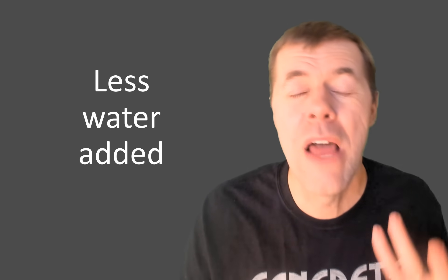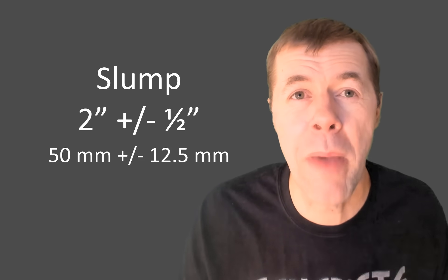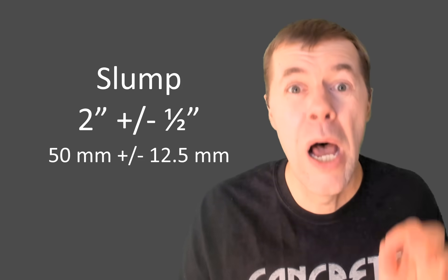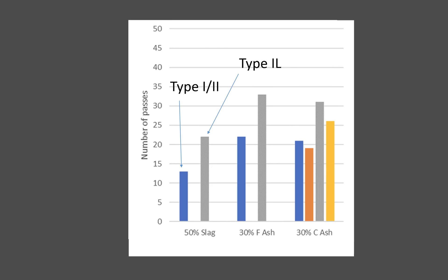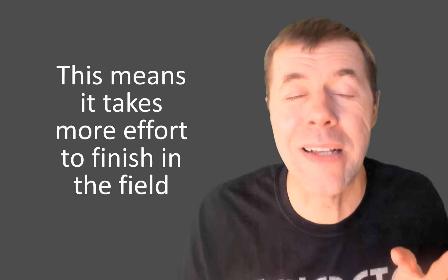Does this really work? A third-party group — not me — compared different types of cements. They made concrete mixtures with the exact same slump and same everything else, but different cements. Here it is at zero passes, and here after 26 passes. The y-axis shows number of passes — lower is better. Type 1-2 is shown on the left and Type 1L cement on the right, both with and without Class F fly ash. The 1L had higher pass counts — it took more effort — and that was consistent across two different 1L's and two different 1-2's. Every single time the 1L took more passes.